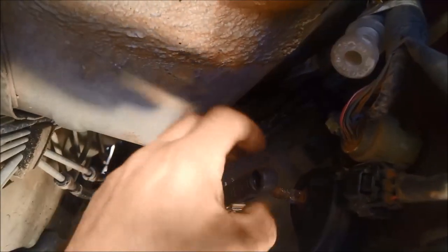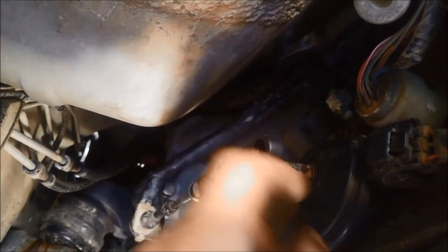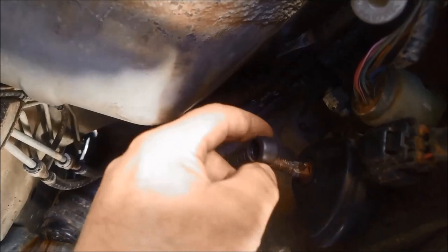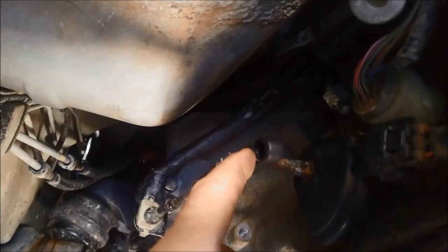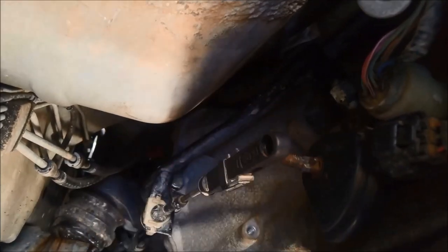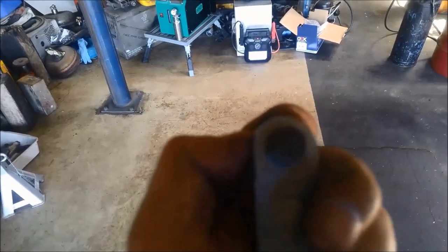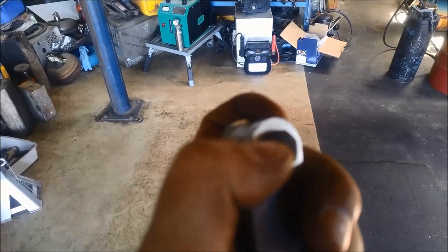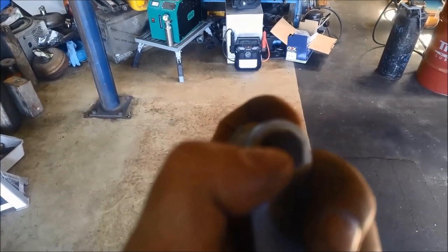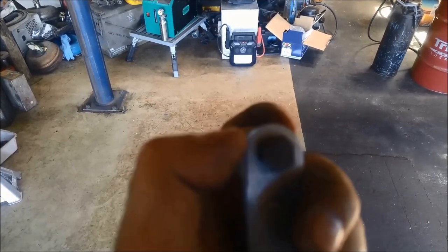What we can do is make a little modified bush on here with a bolt through the bushes and little lock nuts instead of that push-on clip. Just knocked out that little bit there, grinded it off and punched it out, and I found a nice snug bolt, which is a 5/16 with a little flat bit right up the end — it hasn't got the thread all the way through.